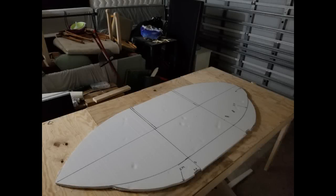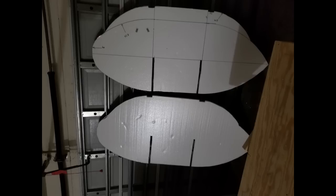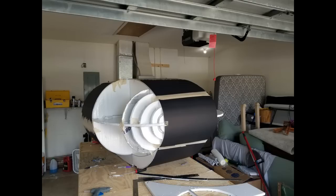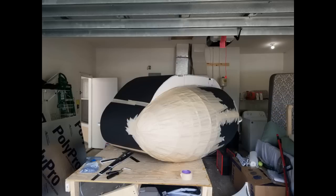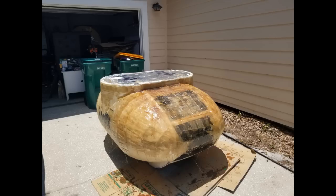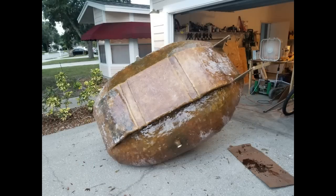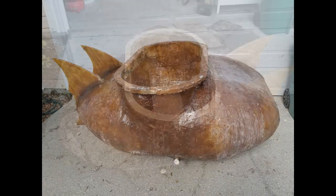The entire vehicle is a single fiberglass shell built over a disposable mold. I used insulation foam to create the profile of the hull and cross sections at several longitudinal stations. To cover two-dimensional curves, I bent Dollar Tree poster board, and for compound curvature, I built up a surface with masking tape. Once that was done, I began layering fiberglass over it. I did this for several weeks, and probably went through about 20 gallons of polyester resin, until the entire structure was finally rigid enough to stand without a mold, and I dissolved it away with acetone.